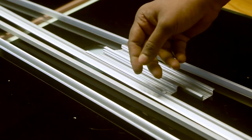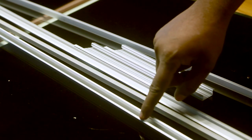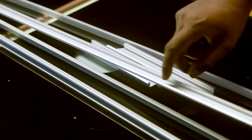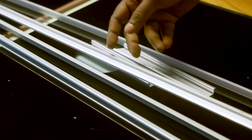This is a 15 mm one — a very standard one that we use almost everywhere. It comes with a depth of around 10 mm. The more the depth, the more the diffusion happens. The 10 mm profile has a depth of only 5 mm, so diffusion is actually less. This shallower profile is good for 240 or 120 LEDs per meter, but the most common ones are the 15 mm by 10 mm depth profiles.